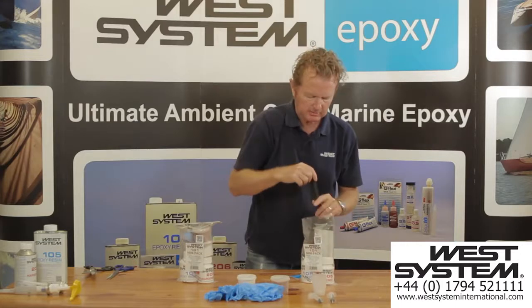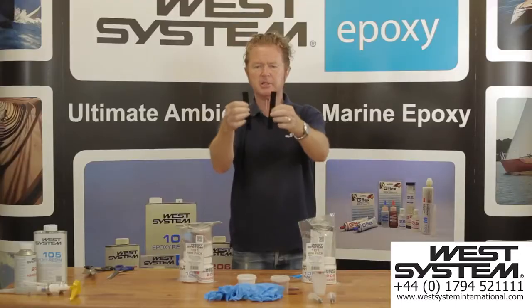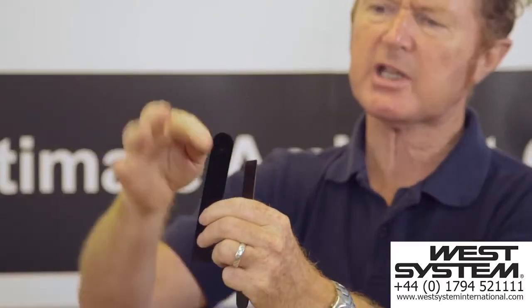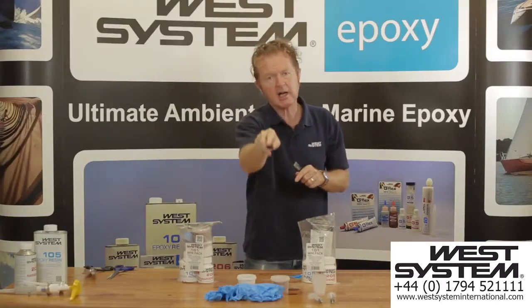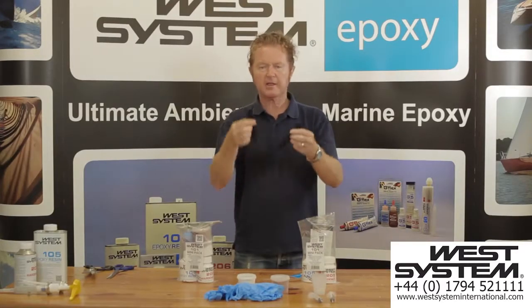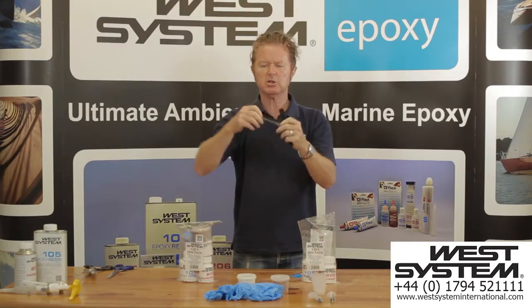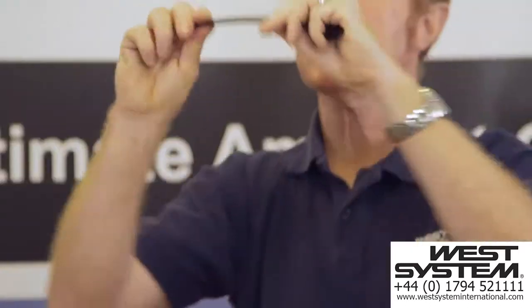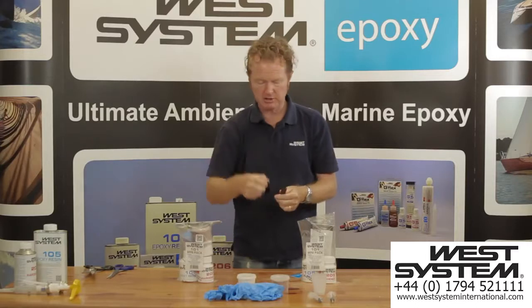You have 2 West System mixing sticks. These are polypropylene mixing sticks. They have a radius end for creating a fillet, and they have a chisel point on the other end for cleaning up after yourself as well. They can be reused for quite a number of times. If you look after them, you can break the cured West System epoxy off by flexing them and then throw away the waste and reuse these.